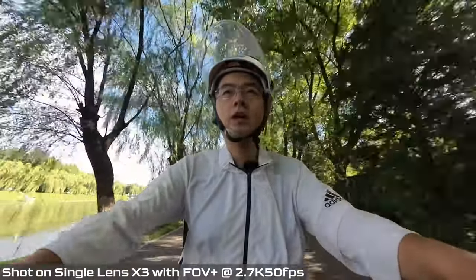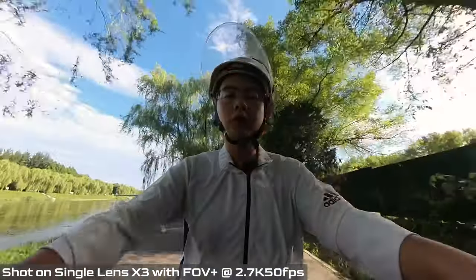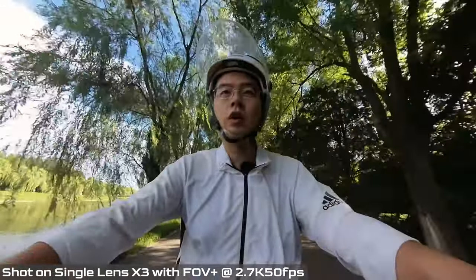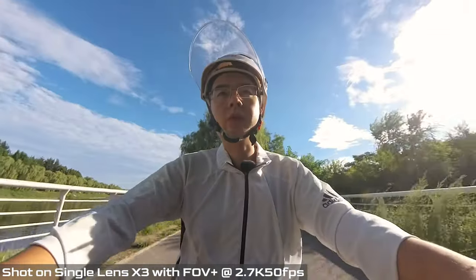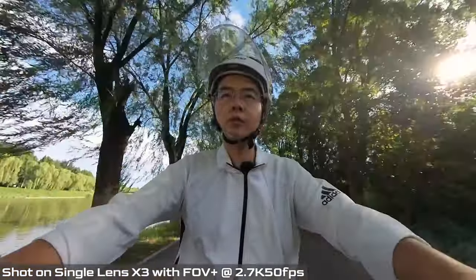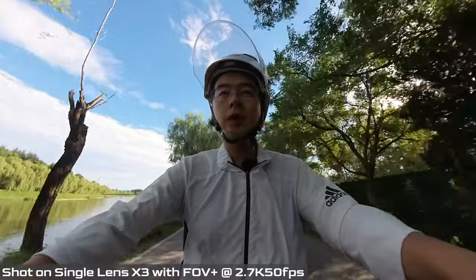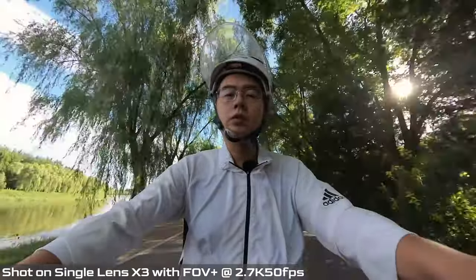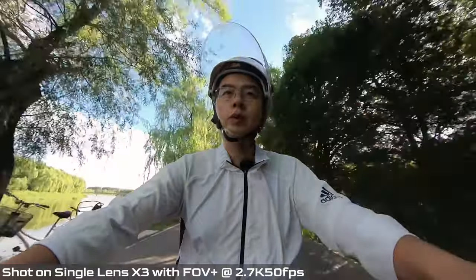You know, with a single image sensor, it has 8,000 multiplied by 6,000 pixels, that is an 8K image sensor. So even with internal circular fisheye and make internal crop on the basis of the circular imaging circle, you're still capable to get 4K resolution if we perform the full sensor readout at some specific area of the sensor plane. But at the same time, if you perform at 4K resolution internal circle, and by cropping in like the circle, you also get a 2.7K at the maximum 50 or 60 FPS.